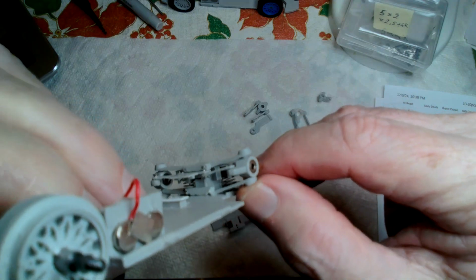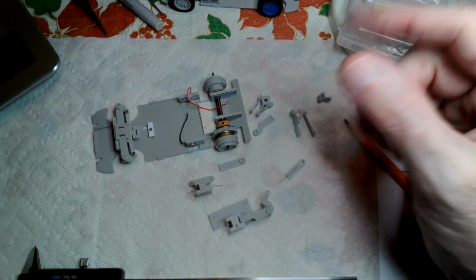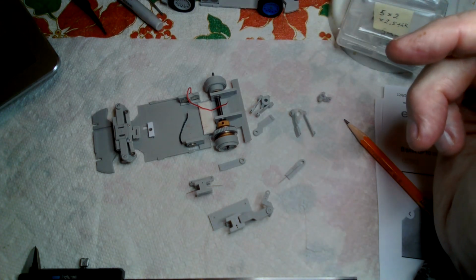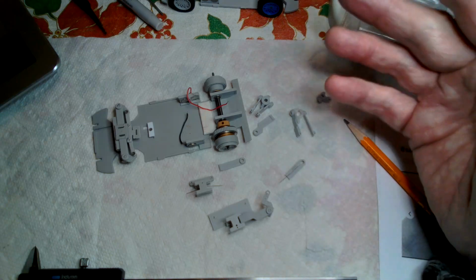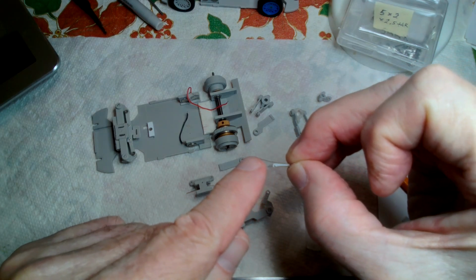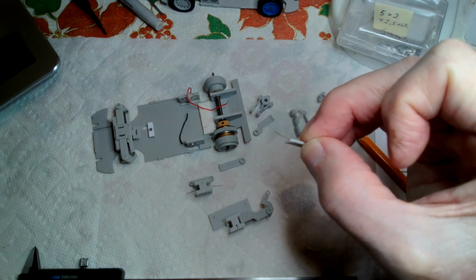The coil spring works well, but coil springs, if you go to buy them, and particularly if you want an assortment, fine gradations of coil springs, I don't know where to buy them that I'm not dealing with a company that wants to deal with manufacturers and has minimum orders. You can buy Mini Z springs, a little assortment, but they're $7 or $8 for a couple of springs, and these, for a few dollars, you could do hundreds of cars. Also, you can buy an assortment. This is 10 mils, but you can buy 10, 11, 12, gradations, until you could tune the suspension without paying an arm and a leg for the springs by buying an assortment of the springs.